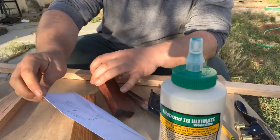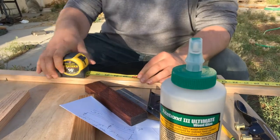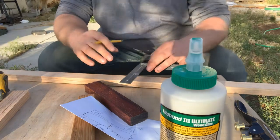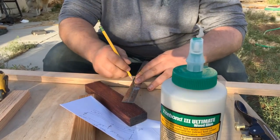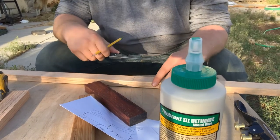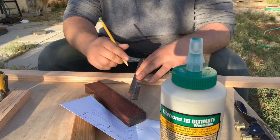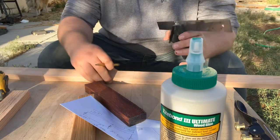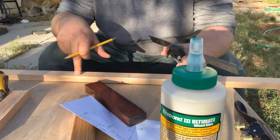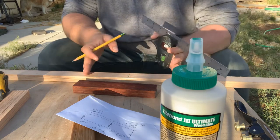Now I need to find the measurements. I go to the halfway mark — half of 64 is 32 inches — and mark a center line using the square for a nice straight line all the way across. I'm marking this on the back of the bow, which is the face that points away from you when shooting. That way I can still see my notes after the cocobolo handle is glued on top.